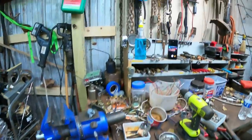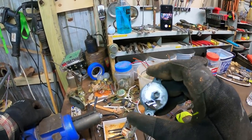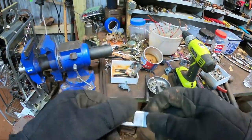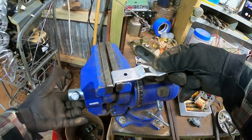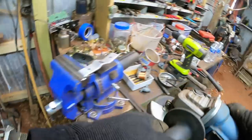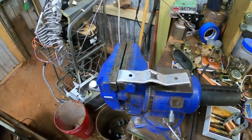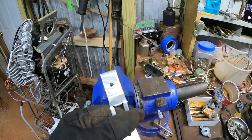But just take a teaspoon of it, mix it up into a spray bottle. That's a good size spray bottle, so it may be a little weak, but you can definitely see how that turned black. So that's how you can tell aluminum with copper sulfate. Here's a little piece of aluminum. Spray it on there. It's not turning. So that's how you tell.